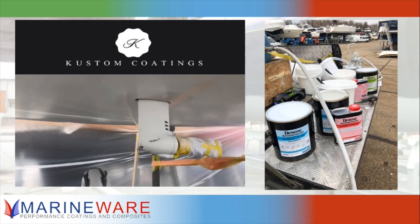I did get into trouble once doing a demonstration with clear on a timber cockpit table — showing how fast the accelerator works. I got distracted talking and when I looked at the gun the paint had turned to jelly. You do have to properly clean the gun between coats when using accelerator or it will set in the gun. Duropox sticks everything together, and the Extreme version is even worse.